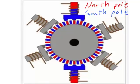So in this picture, the North Pole is shown as red and the South Pole is shown as blue. Now, when we put a current across one of these coils, which is shown here as these T-shaped parts, the pole that we put the current through is magnetized. The part of the pole that has the little gear teeth, shown here, is magnetized as a south pole. When the pole is energized and hence magnetized, the same pole teeth in the rotor are repelled and the opposite pole teeth in the rotor are attracted. You see in this picture how the north pole teeth, shown in red, have lined up with the south pole teeth in the pole.